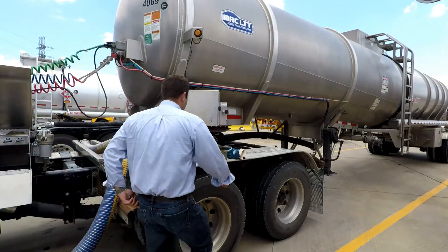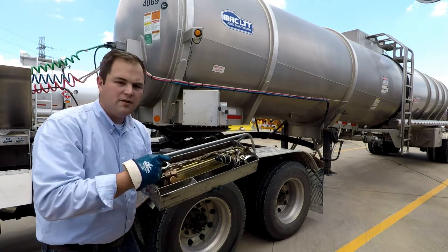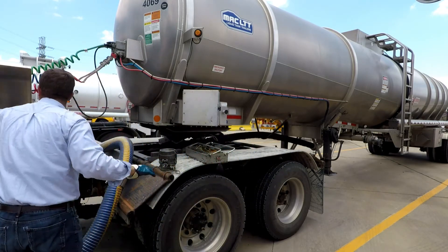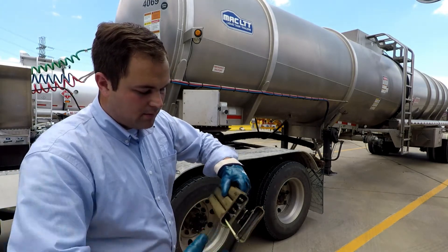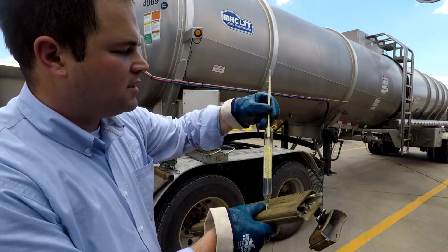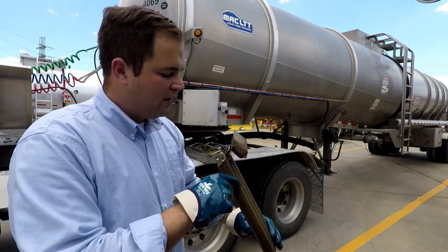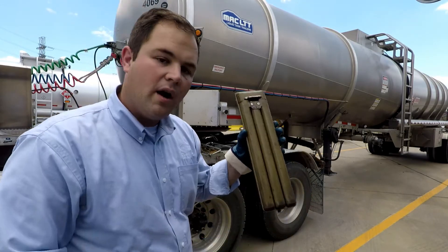Now we can go over the tools in the gauge tray. Here's the gauge tray — we can see the thief in the middle, we have a wood back, and we have our gauge tape. Also commonly inside the gauge tray we would have our hydrometer case. We can pull our hydrometers out and make sure we've got all the correct ones. This one has all three of the range: a 41, a 51, and a 61. In the case we've got the felt — this one is missing the felt, and we want to be very careful with that as it can lead to breaking the hydrometer quite easily. But we've got all the components there, so that's good.